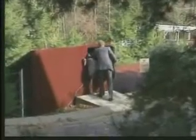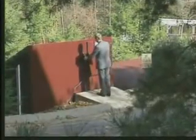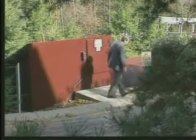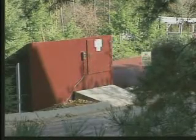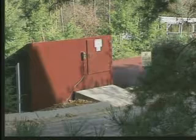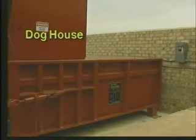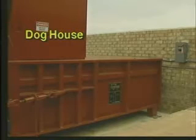If it is important that others don't have access to your papers and discarded waste, then the loading opening should be key controlled for security, to help prevent theft and to safeguard the well-being of your employees. A total enclosure over the loading opening with a key-lock door is also known as a doghouse. The doghouse is the preferred arrangement when the unit is to be hand-loaded from the ground level, like this RJ225.